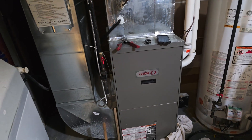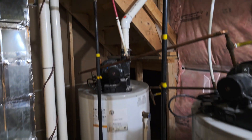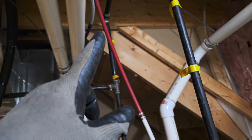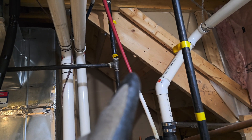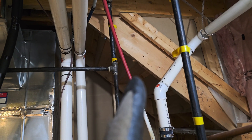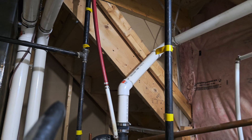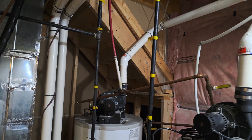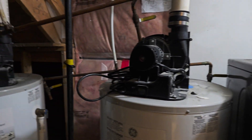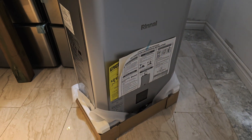So we are approaching 350,000 BTU already. If your gas meter is not properly sized, or the gas line is not properly sized, you won't be able to put in the tankless. You need to check with your gas supplier how much your gas meter is rated for. For example, if your gas meter is sized at 250,000 BTU, you need to upgrade it. Now, if I already have 350,000 BTU and I remove these two tanks — that's 100,000 BTU out — I'm left with 250,000 BTU.